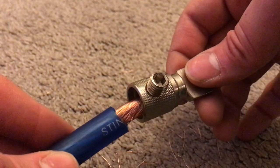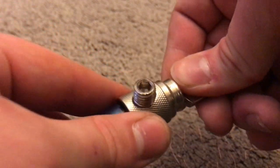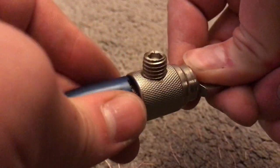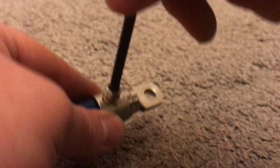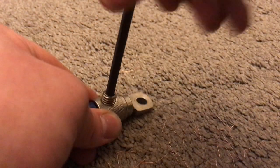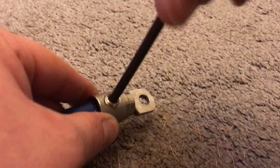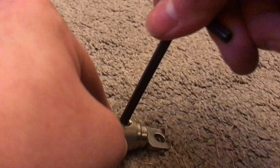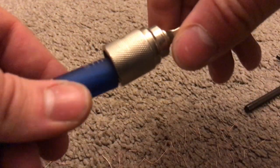Very, very easy to use — no hydraulic crimper needed. Great for beginners or if you don't have a crimper or need to get the job done without one. So just go ahead and screw that down. Be sure to hold the power wire and push it towards the ring terminal for the best contact. And there we go, it's done.